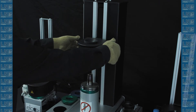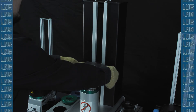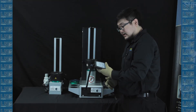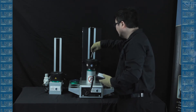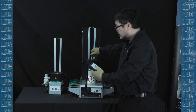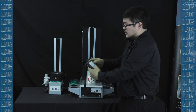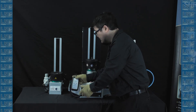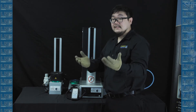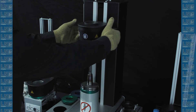Now you're ready to shrink. Make sure you use two hands to lower the heating head. Once the heating head is lowered, grab the controller and your cutting tool. Feed the cutting tool down, hit the heating button in the middle, and the heating starts. It locks out, so now the heating process is complete. Again, please wear heat-resistant gloves before you proceed. Use two hands to raise the head.